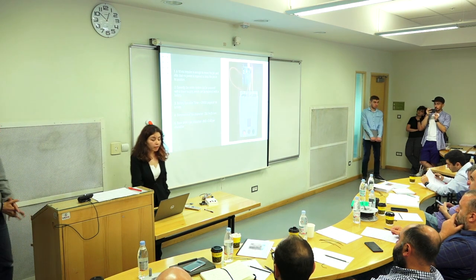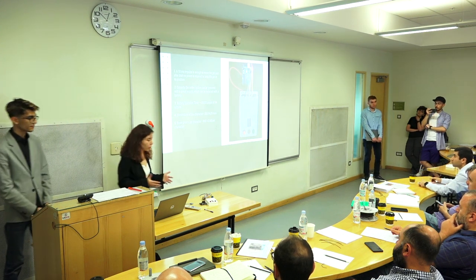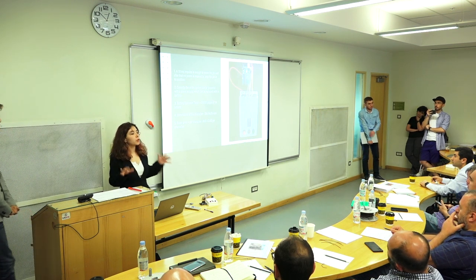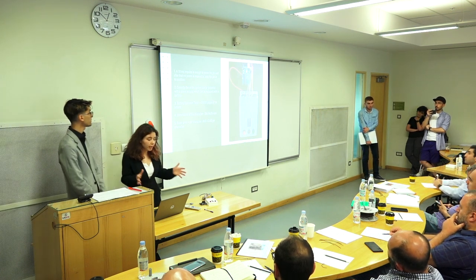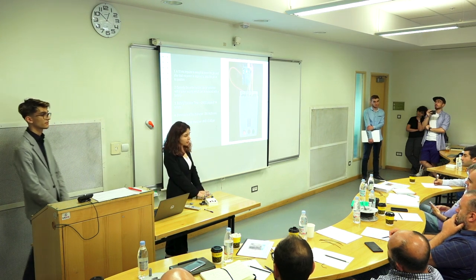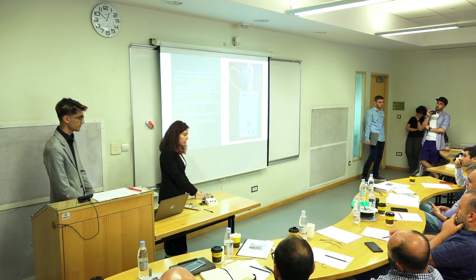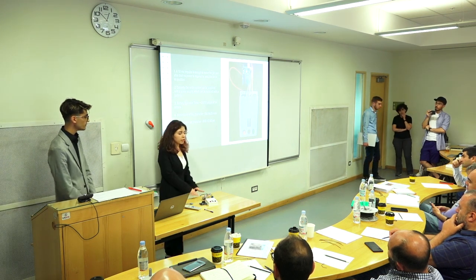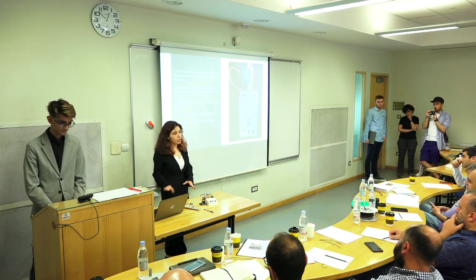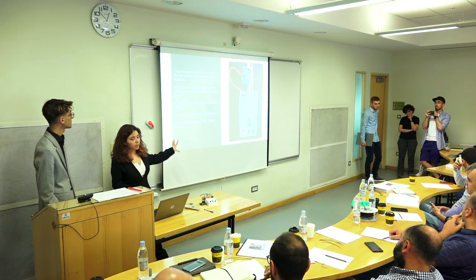So our final results, what we achieved so far, is that we are able to control and move each pin using only a 10 millisecond impulse, and after that, the pin is able to keep its position without any power being supplied to it. Currently, the entire system can be supplied by this 12-volt, 5-ampere power supply, but a battery with the same characteristics can be used to replace it, so a socket would not be required. We found out the battery requirements quite late in the stages, so we weren't able to order those batteries. Battery operation time was 29,000 pages, as we said.